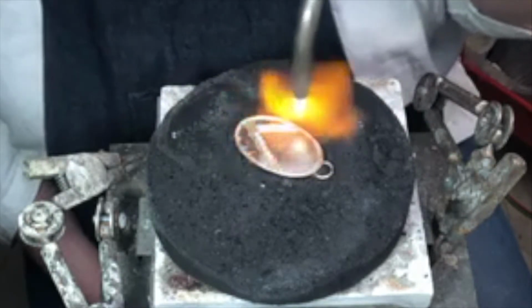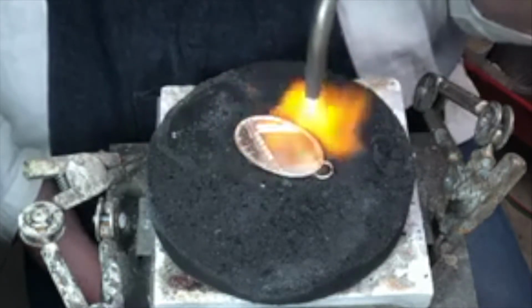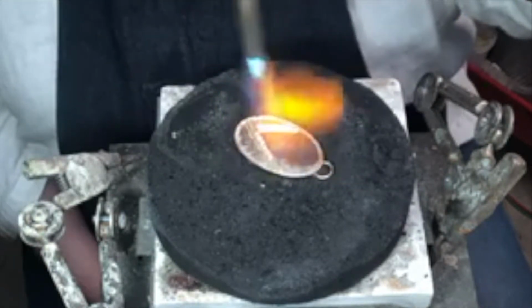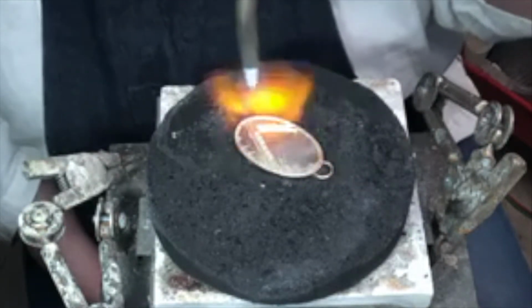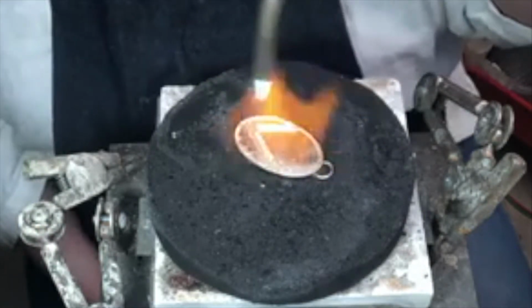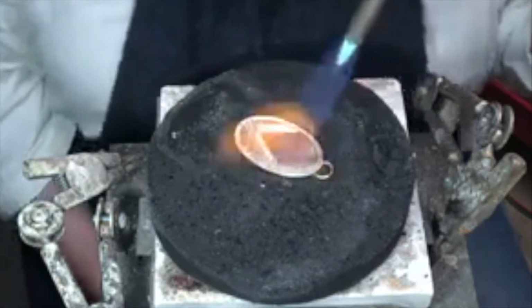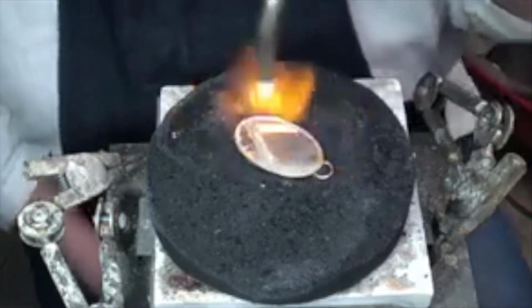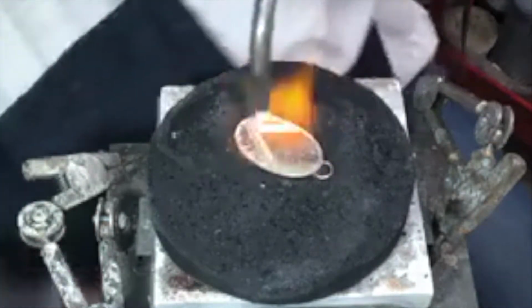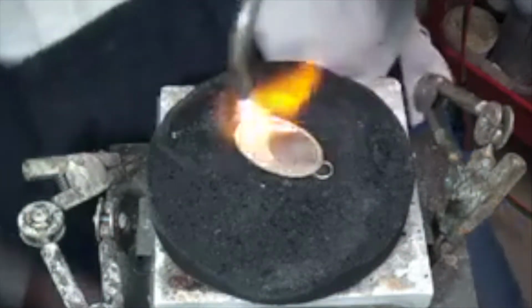Now also what I'm looking for is I'm looking underneath the wires and the granulation to make sure that there is a white line. That is where the Argentium has oxidized and the germanium oxide has developed on the seam. And I believe we are good and fused.